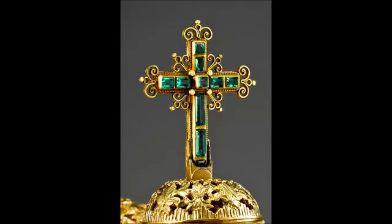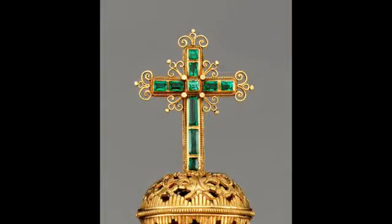The curator was unhappy with how this modern mount obscured the bottom of the cross here, and asked the conservator if she could create a new mount. Linda created this really beautiful, discreet mount. Basically, this whole section in through here is new. It's a brass piece that she initially carved out of wax and had cast in brass, and then filed to perfectly fit the cross, and then I believe it was attached with reversible glue somehow, but it was a huge improvement over the original mount.